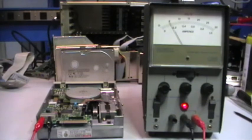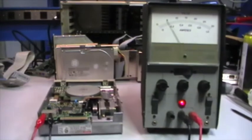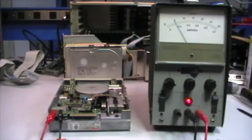Actually right now I can't remember which side of this Molex plug is the plus 12 and the plus 5, so I just measured 5 volts on both sides, and that's it. So the unit seems that electrically does not have particular issues, so I think we can have some fun trying to connect it to the computer that is right behind it.